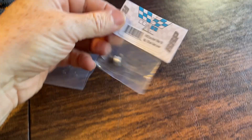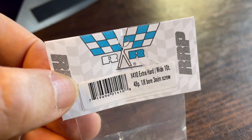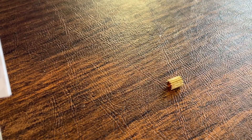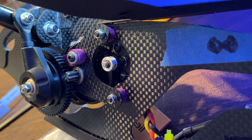In the end I got online and found a 48p 10-tooth pinion gear that has a set screw, and this made all the difference. I was able to slide off the original pinion gear and add this one. Obviously I ordered two, which is why I can demonstrate that — and it works great now.